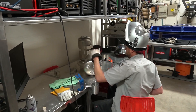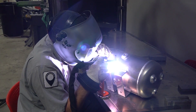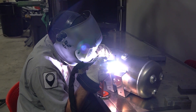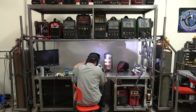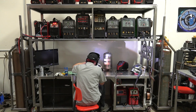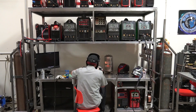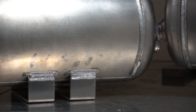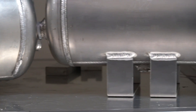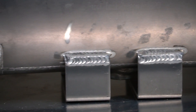That's really all we're after here. It's going to look like there are two welds stacked on top of each other because there are. But we're not going to hurt the integrity of this tank — we still have to maintain that. We're less apt to having issues with pressure or leaks when it already passed inspection with the original welds. So that's why we're welding just to the original welds. Here's your side-by-side — one shortened and one original. Looks like this will do the job, no problems. After another quick inspection and a pressure check, we're good to go.